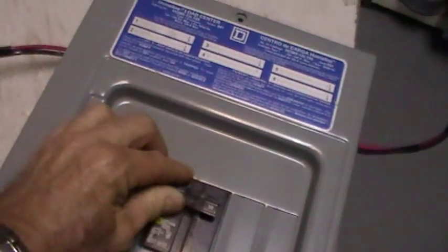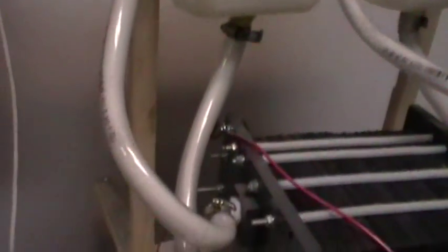There's 220-volt wall current coming in. Steve used a portable generator, and we'll give this thing a crank. Turn the switch on — and here it goes. Instantaneous. There's the gas coming up the pipes and tubing.